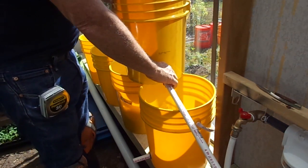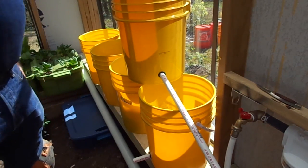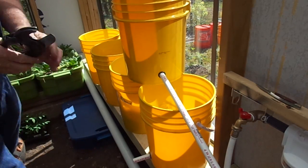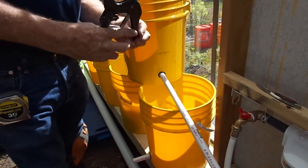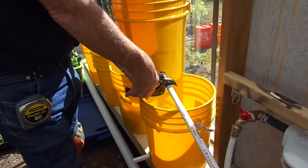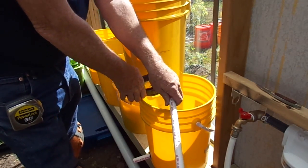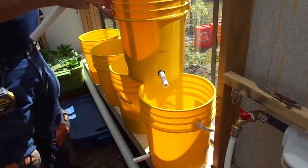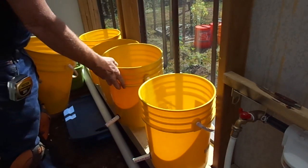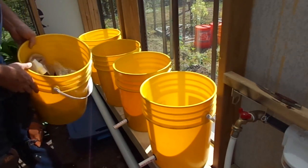The last thing you do — since I don't know my exact measurement — I need to cut the PVC pipe off so that it will be a little bit longer than I need and I can cut it back. You can use your PVC tool cutters; it's real easy. You just start to squeeze it and it cuts all the way through. Once that's done, you can continue putting them in your row as we get ready to connect the drains and put the half-inch pipe down into the drains.